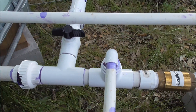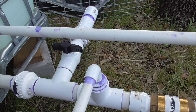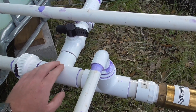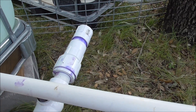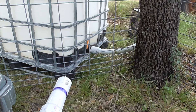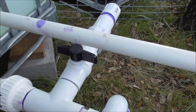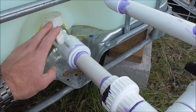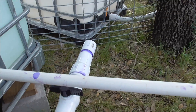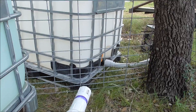Now another thing we did: we have another tank that we run to the rancher's house to get water — it's a bigger 330-gallon tank. We've got an inch-and-a-half tee right here that comes off, and we're going to get some unions and connect that. You can see that hose on the other one — it's a two-inch spa hose, heavy wall, for suction. What you do is block the main tank valve and open the black valve, and it pulls suction through that hose from the other tank, which will be on a trailer coming from the rancher's house.